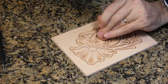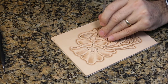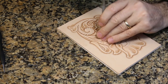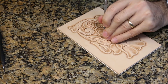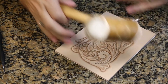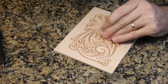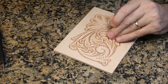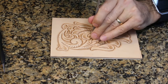To make sure I get the right amount of depth, when I have a larger background area to cover I'll go around the outside — right up against the leaf or right up against the edge of that area with my background tool — making sure I get as much depth there as I need. That also means I need to be really careful that I don't take a bite out of the edge of one of my leaves at this stage.